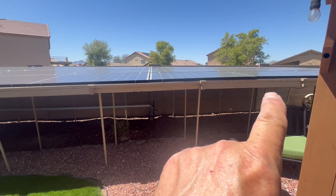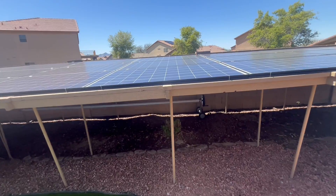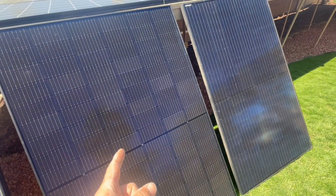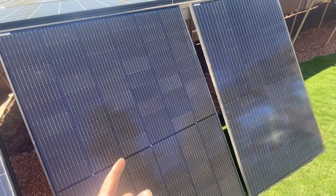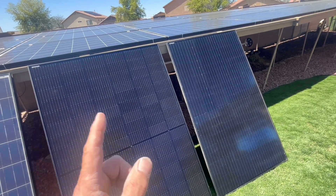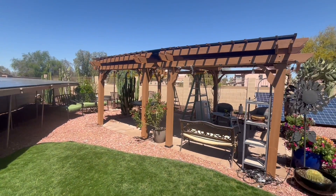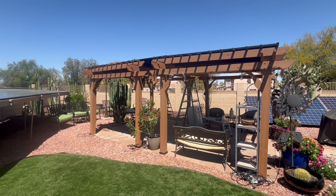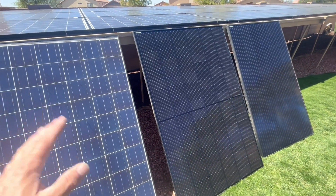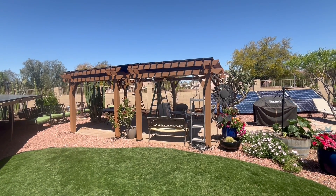Over here, there are 24 panels at 6,000 watts. If I had 15 of the new 400-watt panels, that would give me 6,000 watts plus an extra 1,500 bifacial — nearly 7,500 watts versus 6,000 from 24 panels. We're going to bolt the new panels down because the old ones were just laying there for three and a half years and we lost two of them during the monsoon. Then we'll connect them all together and see what we get. We'll see you in part two.